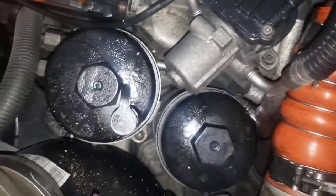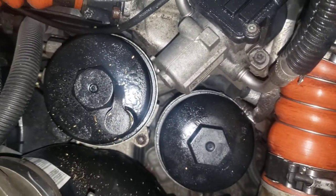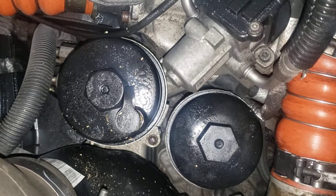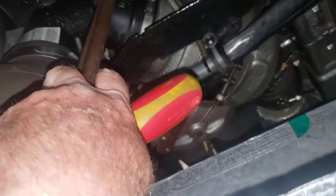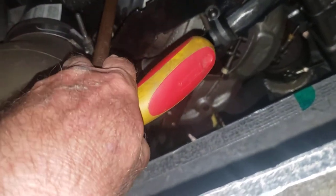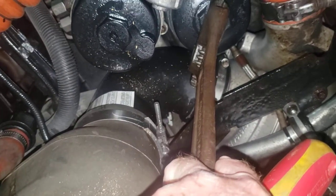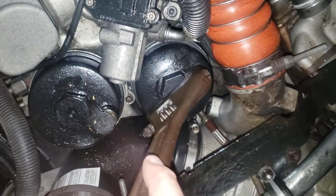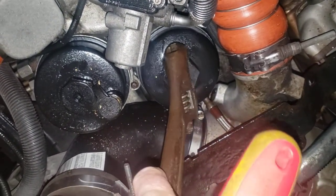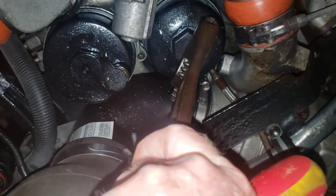So what I'm going to do is take the filter out. I'm going to change the oil on the MaxForce diesel engine. I'd say I'm using a 12-inch crescent wrench. I'm going to put a screwdriver through the hole on the top. I have an inch and a half socket — it fits the one on the left but it's a little loose, and real loose on this one. So I'm just going to use the crescent wrench and turn it with the screwdriver. As you can see it's turning — the screwdriver is just giving me some help holding on to the crescent wrench while I'm turning it.